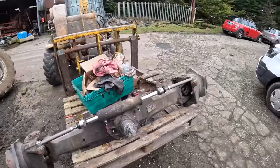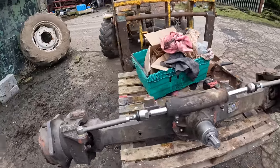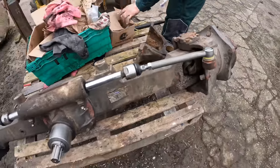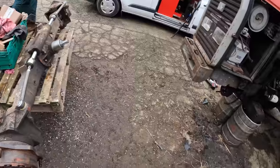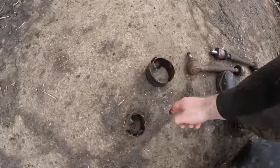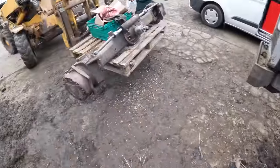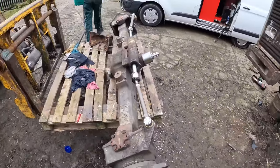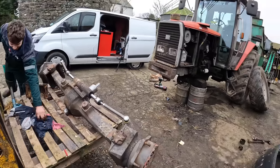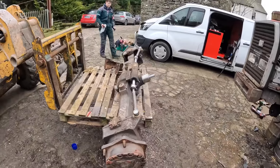Another day, we're back — Robert's back and he's ready. New track rod ends, new inner ball joints, new bushings gone in, all tight and ready. New bushings gone in there, all bushings here. One wasn't too bad but the other one had worn through — so those are the two old bushings out. Ready to go back in now, all done. We'll be pulling beet after dinner, I'd like to think. Hopefully nothing else breaks down. Anyway, time to get this axle back in.